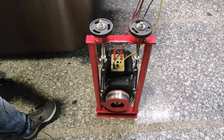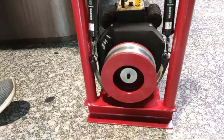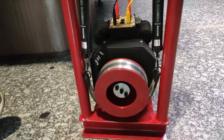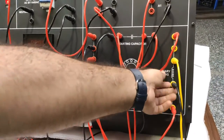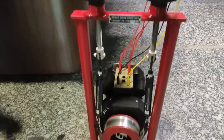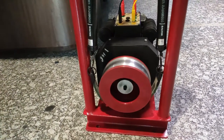Having already made the connections from the earlier experiment, we start the motor and observe the direction. We can see the motor is rotating in the anti-clockwise direction right now. After stopping the motor, we change the auxiliary winding polarity by interchanging those connections. We then start the motor again and observe the direction, which is now the clockwise direction — the reverse of before.